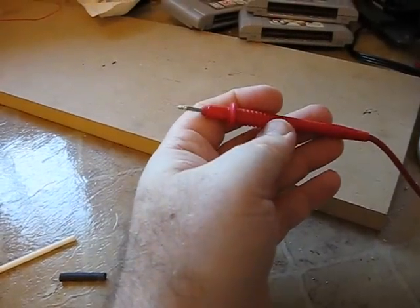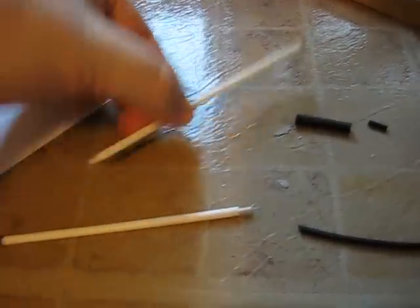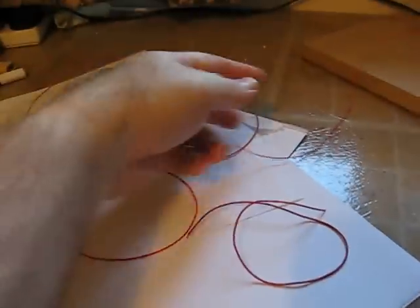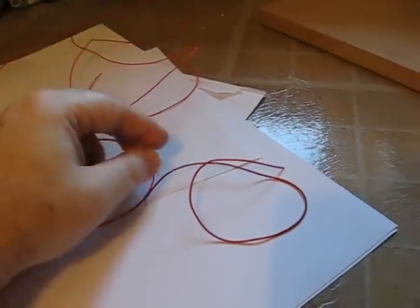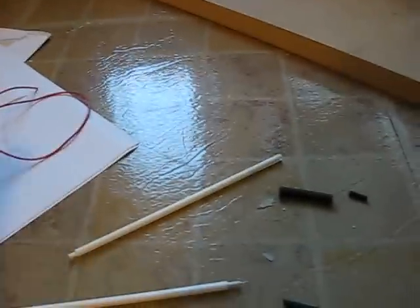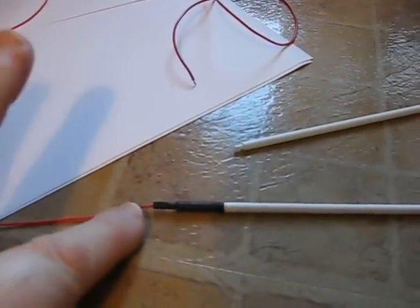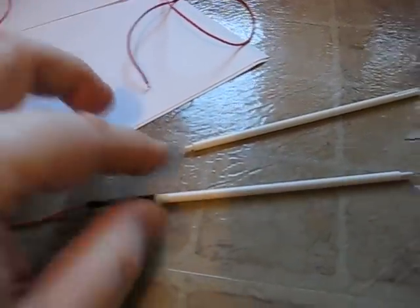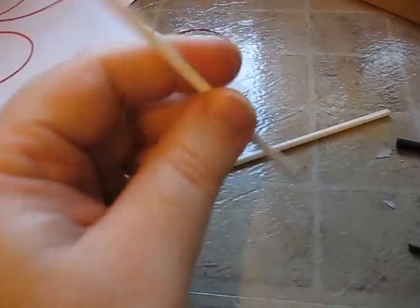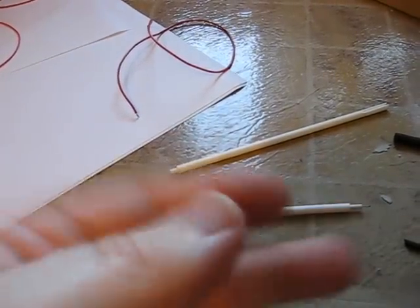I decided while I was at it that I'd make a new rod. This is what I've ended up with, using a plastic tube for a handle and a wire which is about three or four feet long for the rod, with a thicker piece that needs to go through the tube and not be so flexible. I then tinned the end of this, pushed it through the wire, super glued the end so that this rod stays in place, and then used two lengths of shrink tube — the small one at the back so that when I put the large one on it will hold itself in place. I've ended up with a very easy to use and very useful probe rod for the multimeter. I'm just going to do the other one and then move on.